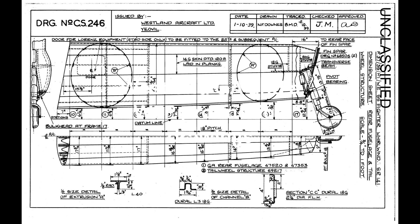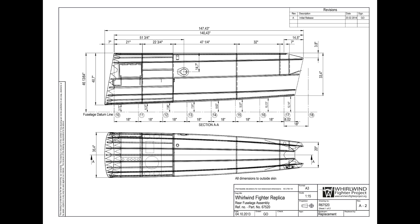The form of the lower fuselage is much more complex than the upper section. The upper section has an ogival cross section while tapering in a teardrop plan form from the cockpit section joint to the tail fin joint. The added manufacturing complication for the lower section is the additional upsweep from the cockpit joint to the tail joint. The upsweep is not a linear transition — it requires a variable curvature along its 12 and a half foot length.